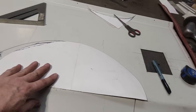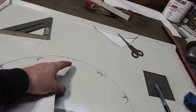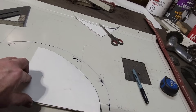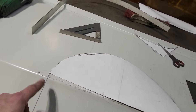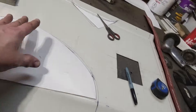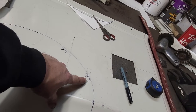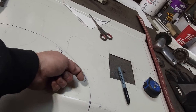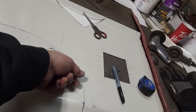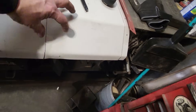I'll use a template. Yeah, that's it. The world has ended. Fitzy has used a template. What I went and did here is I had this distance across here. I had an idea how high it had to be from these two bolts here. I knew I had to go crown up a small bit from there. I cut this square piece out, the full length of that there, then I folded it in half, drew it over where I thought it might be, and trimmed it off. Now I lined that up there and traced that out — there's my mark. I don't want to come too hard, I just want enough clearance from the head of the bolt. It's just a matter of being able to take the bolt and slide it in there.